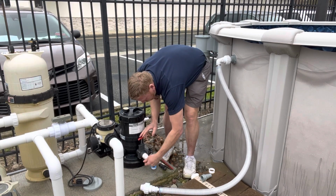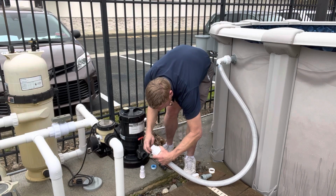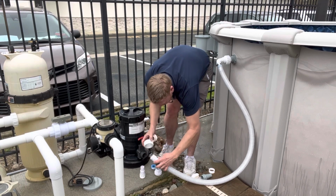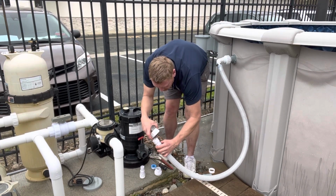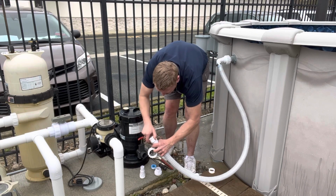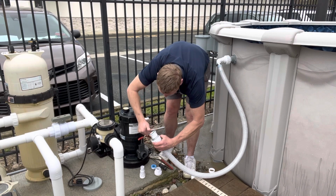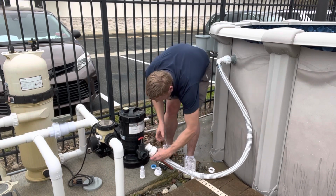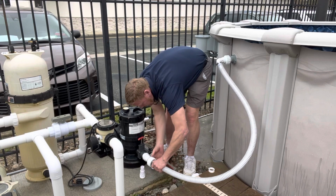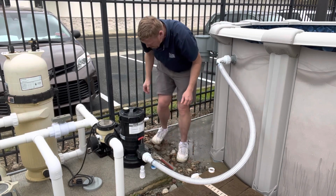This filter has a gate valve. If it didn't have a gate valve, either way, there's always going to be an inner thread. So do the same thing on this end, and I'll show you what I just said a second ago, just so that there's less confusion. This piece comes undone. You have to put Teflon or marine grade silicone on that, and then put this piece back on. Oops. Yeah. And then, again, Teflon these ends. Tighten that.